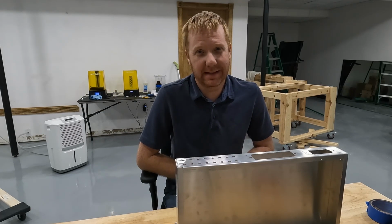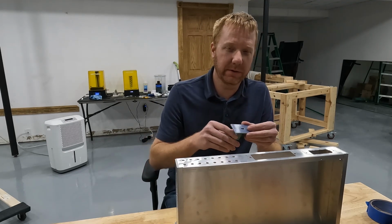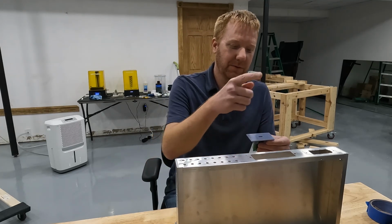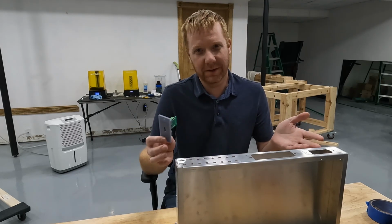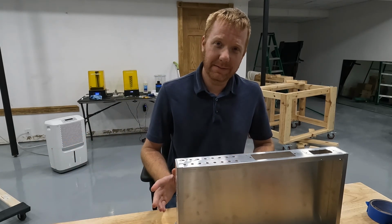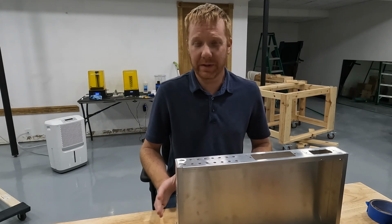When I first came up with this concept, my plan was to use an HDMI connector to connect different controllers into my modular controller. So just for example, you could hack into multiple controllers like a Super Nintendo or a Sega Genesis or an N64, and you could interface that controller with the modular section of the controller via HDMI. And I thought I was being really clever because HDMI is cheap and everybody has HDMI cables, and there are 20 pins inside of an HDMI cable. However, I had never cut an HDMI cable in half, so I didn't really know what was inside of it. I just assumed that there were 20 separate wires since there's 20 different pins.